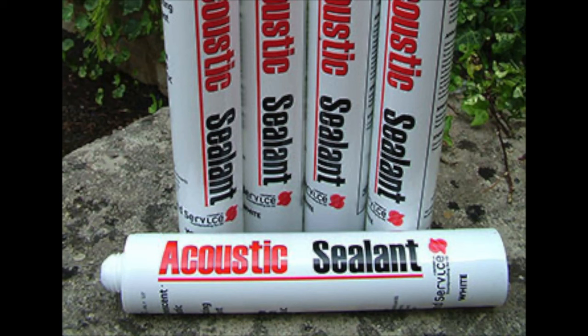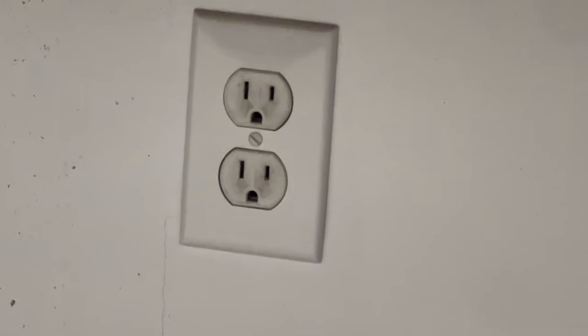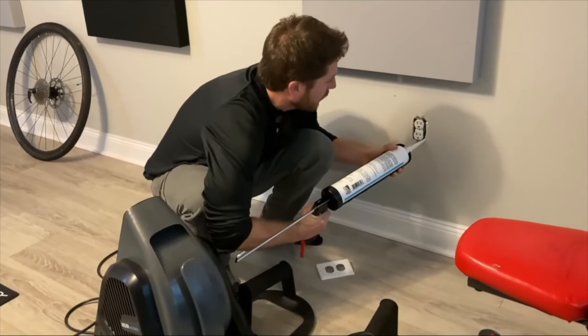After sound deadening the room, you'll still have some noise escaping, so you'll want to seal those gaps. You can use acoustical caulking, but I don't really recommend it anymore because of the expensive 'acoustic' label. A product I've used that works really well at a fraction of the price is Red Devil caulking. You want to use this type of rubbery caulking around your door because it stays flexible over time — all the vibrations and house movement won't cause it to crack and let more noise out. People don't realize that electrical outlets also let noise out of the room.